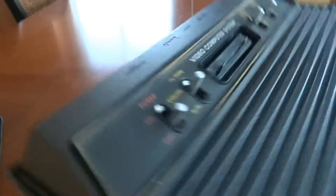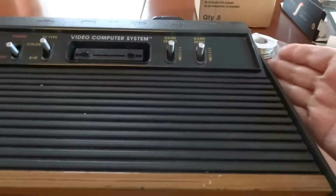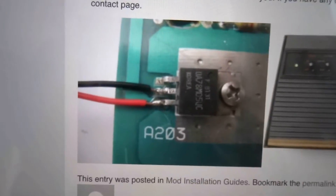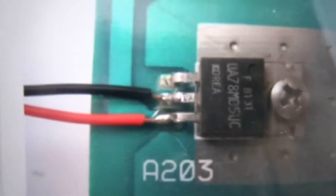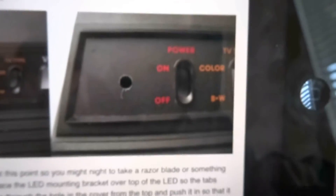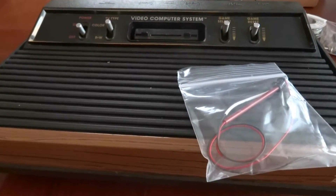I'm here with my Atari 2600, which has already been modded with the video mod. It's worked out very well, although I did leave the chip inside loosely — I want to glue it to the side of the device. Now I'm here to install this LED mod. It's a very simple modification: open up the case, solder the black and red to those points, drill a hole right here, and put it into place. That's what I'm going to do.